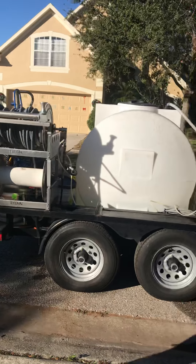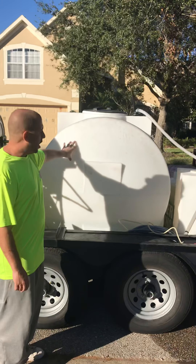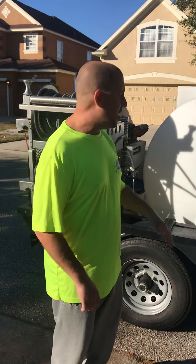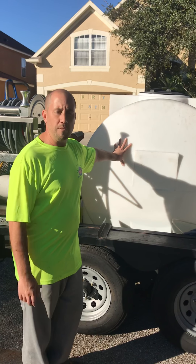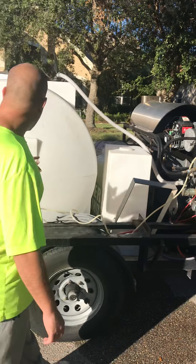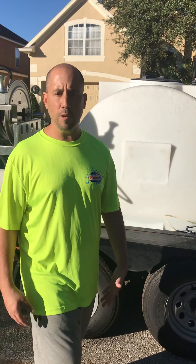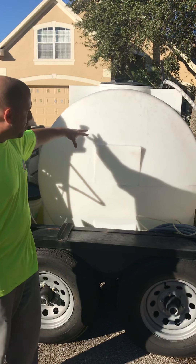The first thing that sticks out is this water tank, also known as a buffer tank. When you get a pressure washer from Home Depot or Lowe's, they're typically three or four gallons a minute and you don't really need a buffer tank because you have enough water supply from the hose directly from the house. Our first machine is an eight gallon a minute machine and the one in the back is a five and a half gallon a minute machine. When you combine those or run just the eight gallon a minute machine, it's not enough water from a regular house spigot to keep up — so that's why you have a buffer tank. This holds up to 550 gallons.